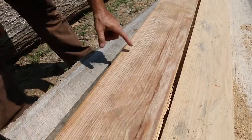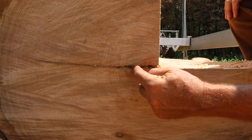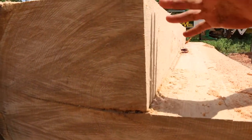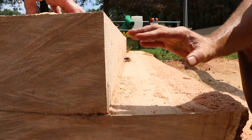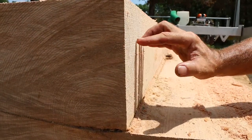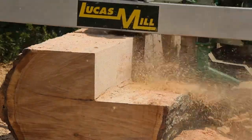See here where we're getting more of that rift sawn look, to where you're getting very straight, linear grain versus the cathedraling that comes from the flat sawn board. All right, we're down to the show boards now. Absolutely. So as you can see, Chuck, our pith is right here. And so like we talked about earlier, we're now getting the grain that's going to be perpendicular to the face of the board. And why we get the show is the tree is made up, of course, of a venous system, much like ours, and they're called medullary rays, and they carry the nutritional substances to the tree. And so they run literally like this. So as we expose the face of the board, we are in essence cutting off the end of the medullary ray, which is where we get that beautiful fleck show or that lacewood effect that you can see. So as we take this off, we'll expose it, we'll take a look at it, and we ought to have a pretty good show of rays right through that board right there. Can't wait to see it.